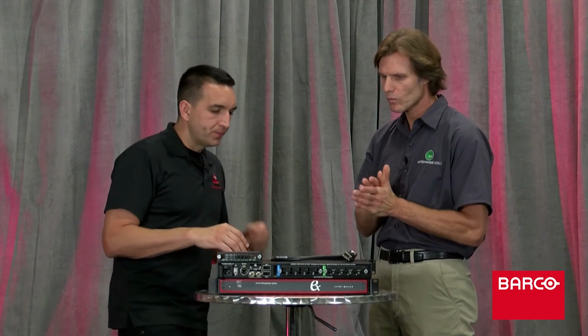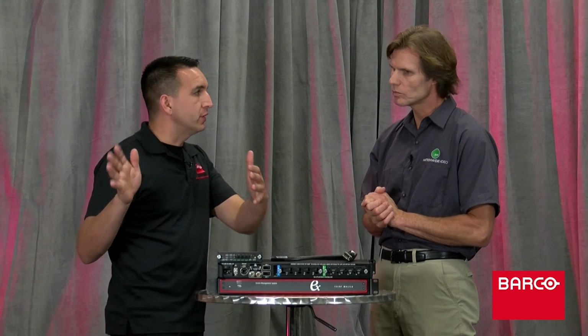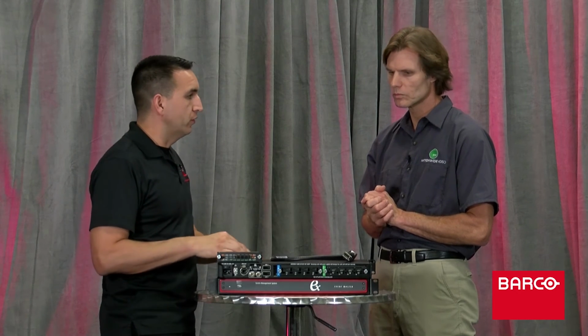All right. So we could keep our E2 or S3 at Video Village, and then we can run out the fiber to an EX that's maybe sitting on a SAT truck. Maybe we'll throw some HD-SDI in, throw some HD-SDI out for some send and receive runs. And we could even take it a step further.